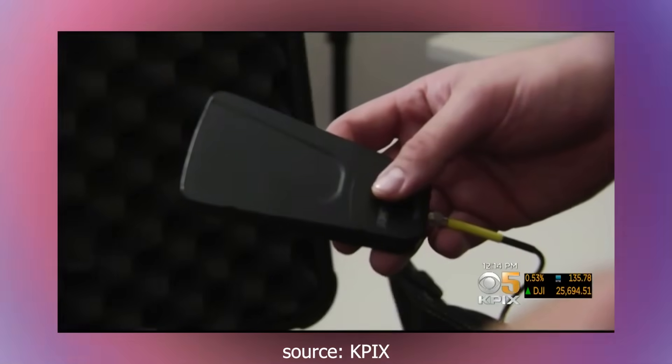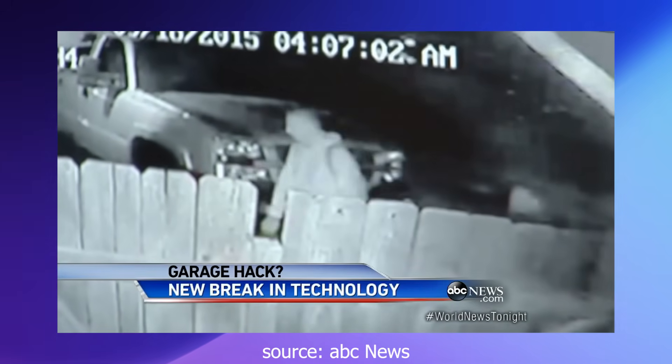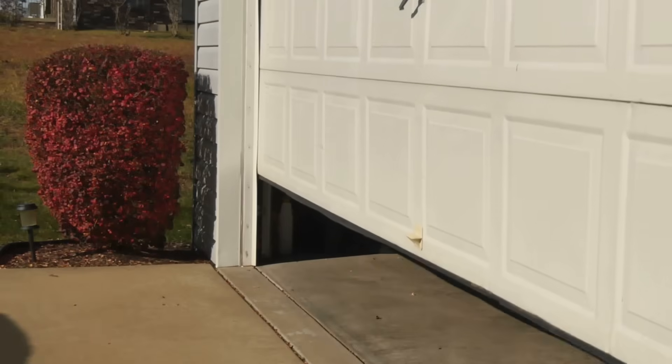In some cases, criminals are using an amplifying device. The next thing is that there's something called rolling codes, and if your gate or garage has that system, then this is not going to work. You need a newer garage door opener that changes the code every time you use it. That still doesn't make it impossible, but it makes it a lot harder. The reason the Flipper won't work on those systems is because when I capture the signal and that random code, the next time you press your remote it's expecting a new code that the Flipper simply doesn't have, so the gate or garage won't open.